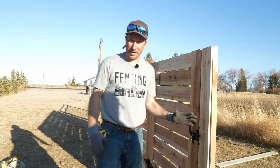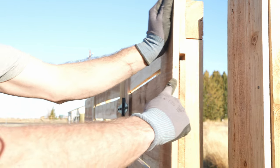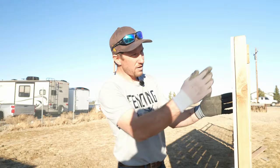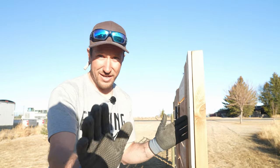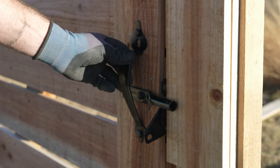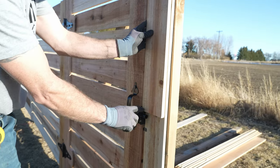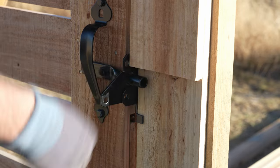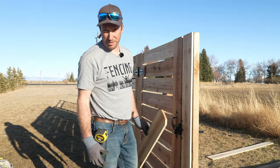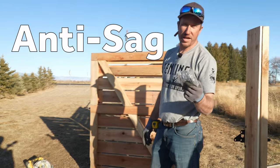This right here is the main fence and this is a trim picket — it's hiding all the fasteners and making it look clean. If this were a continuing fence, you'd have another layer of picket, but if that picket runs all the way down, the striker can't latch. So what we typically do is take a full picket and notch out just that striker area — that becomes our trim plate to cover all the hardware and make it look great.